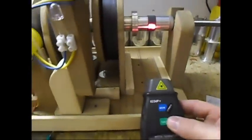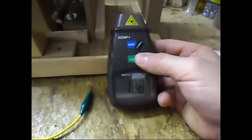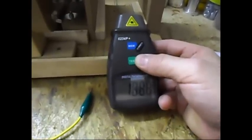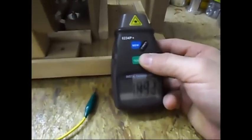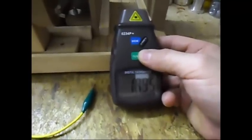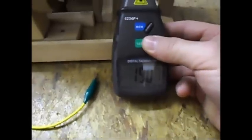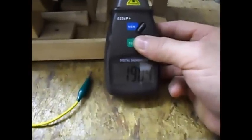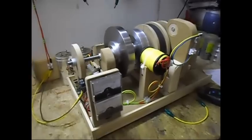Let me check the RPM again — we are almost there. It's going. Sadly enough, the RPM is dependent on the efficiency of the bearing. Sometimes the bearing knocks more than other times. In this case it is less now. The RPM is 1890 as I noted before, but at this point it is running better than the test I did before when I started making this video — I'm already at 1903 RPM and still climbing. It is going to be a little bit of a boring video because we have to wait for it to reach the target RPM.